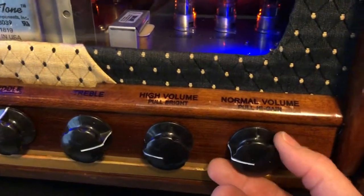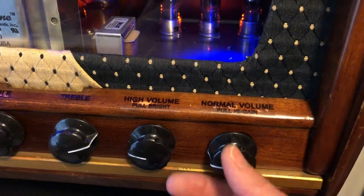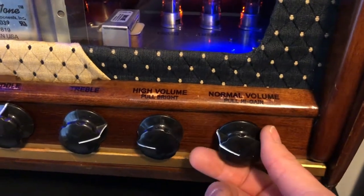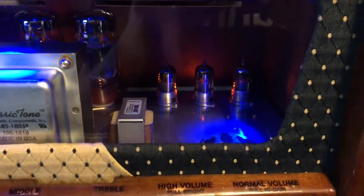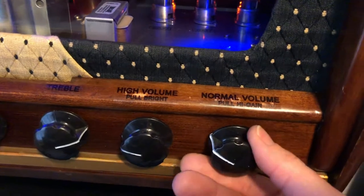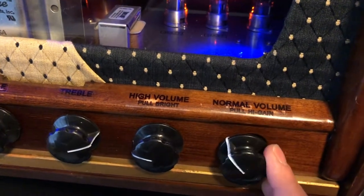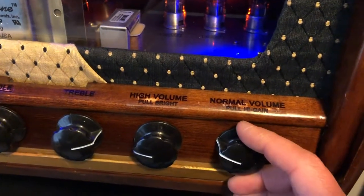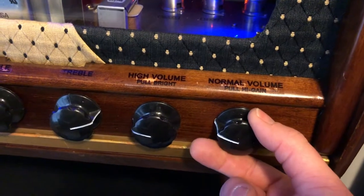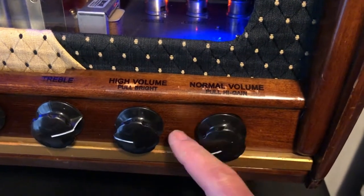But these pull knobs here, so pull for high gain means when you're playing in the normal volume, plugged into the normal volume channels in the back. Some of you may have heard of the one wire mod. It's based off of that mod. And part of the first preamp tube is not used in the normal schematic. So this cascades that and creates a gain cascading stage. So it's adding extra gain into the whole circuit. So the type of gain that you get out of this boost is, I would kind of say, comparable to like 80s hair metal type rock. But it's a really nice feature. It's not part of the original design. I thought I could add that in, and it kind of just gives you more flexibility with how much gain you want to dial in.